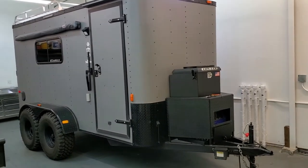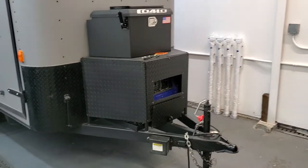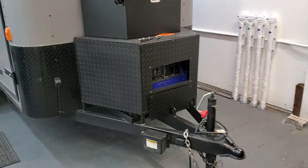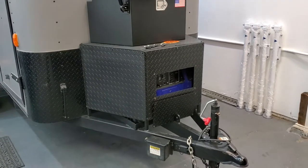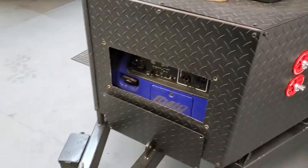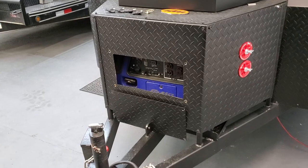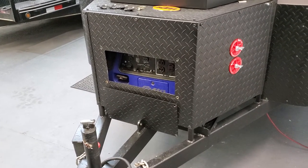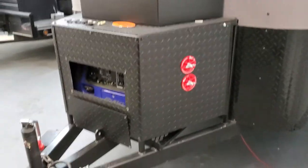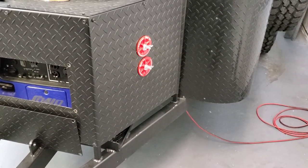The first thing I did when I got it home was build a generator box. I took some square tubing, fabricated a skeleton, and welded that right to the chassis of the trailer. Then I bent up some aluminum diamond plate and built a wrap around it, so the generator is fully enclosed and protected from road grime. Inside the generator box I installed a Yamaha 3500 watt inverter generator. This is a super high quality generator — it's whisper quiet and very smooth, so it doesn't vibrate the trailer. The box is completely open underneath and on the back for excellent airflow, and I added a couple of additional ports to the side for better exhaust flow.